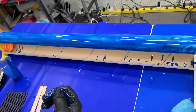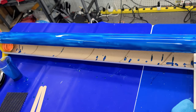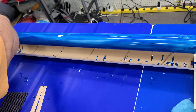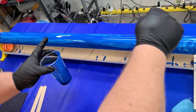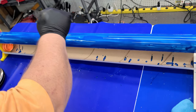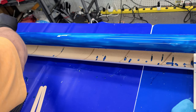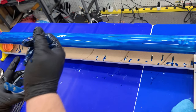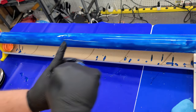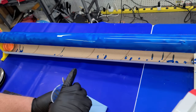You can see there's a good amount of silicone on there now with horizontal lines from applying it — those will even out over time. The key at this stage is to look for bare spots and drizzle on a little bit more silicone to get even coverage. Be careful not to apply too much or you'll get ridges — less is more. Because it's translucent it's hard to gauge depth, but a good rule of thumb is: if you can't see the laser-etched lettering on the PVC tube, you've got too much silicone.